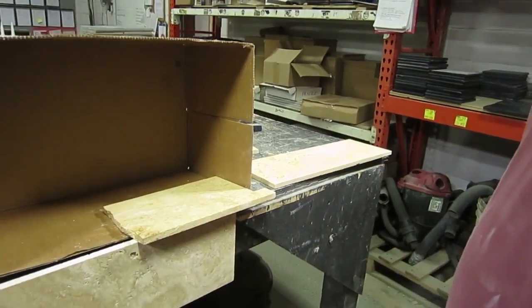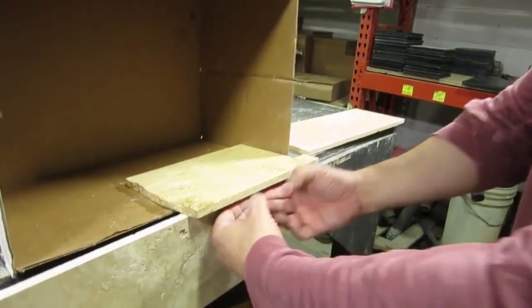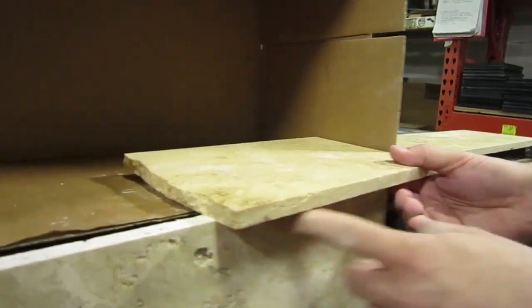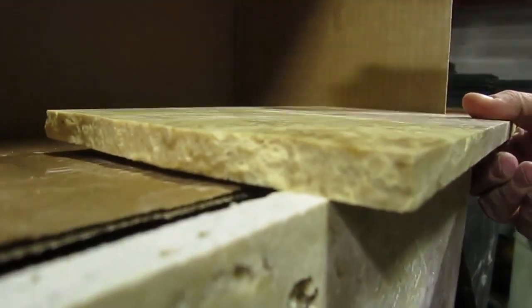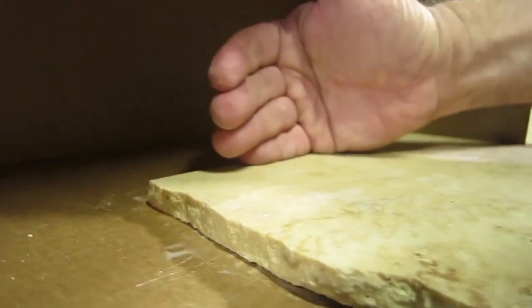The shelf piece is going to go in first. We'll have this wall done here — this will be our final ledge and we'll know where our final area is. We're still going to have a grout joint underneath here, just a tiny grout joint, because we want that to be sealed from water. We'll be adding the shelf in first, then testing and trimming to get the fit of the back.